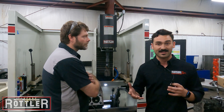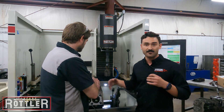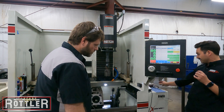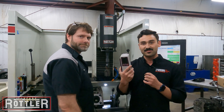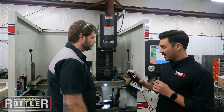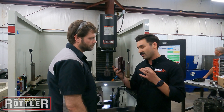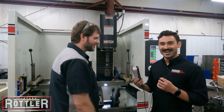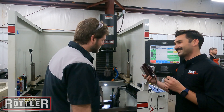And it's called Trace Boss Plus. So over here, as Brian just said, we've been honing on this block, we've just plateaued, and you would normally go in and grab one of your profilometers — one of these guys: a Mitutoyo SJ210 or a Zeiss Handysurf. We're using the Zeiss Handysurf, we also have a Mitutoyo here. It has this tiny screen on it, and you run it, looking for RPK, all the RKs, looking at that tiny little graph, trying to see as much information as you can. And it doesn't — write it down, and you write it down, and maybe you make a spreadsheet, and it's a lot of work.